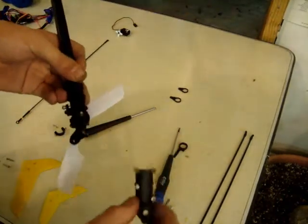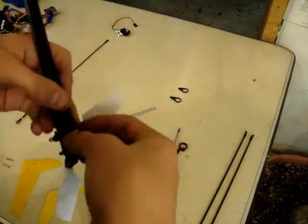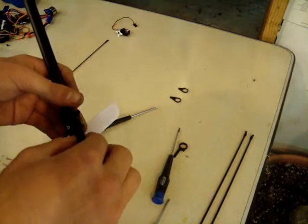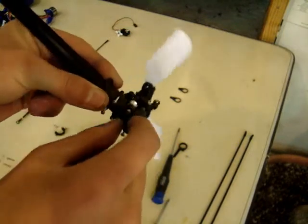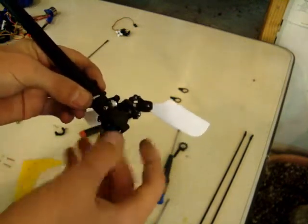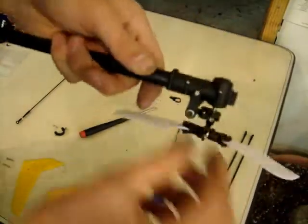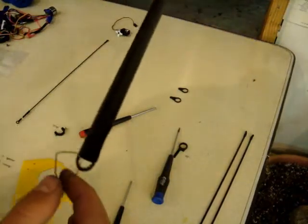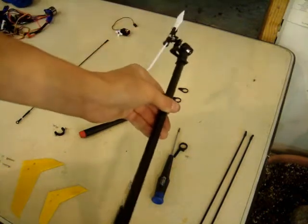You've got your belt in. We're going to grab the other side of the tail case. Stick this little metal spool up on it like that. The other side of the tail case should slide and lock on like this. Then you have five screws that you're going to have to tighten up. Don't worry about these two screws yet — we're going to tighten up these screws here. There's our tail case all sealed up. We can adjust the pitch. This is still coming out like that — we only have one 90-degree twist in it.